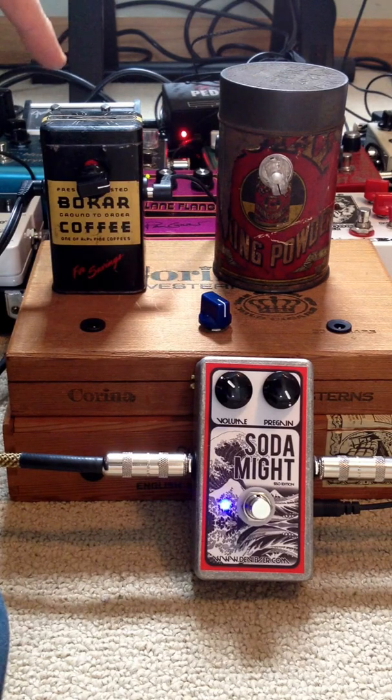So I believe with the resistor I have in here, all the way down will go down to about 4.9 volts. And you'll really notice a difference as we continue to adjust this knob. It's very sensitive, so you can really mess around with it and just dial in the exact amount of starvation to the pedal that you're looking for.